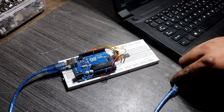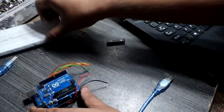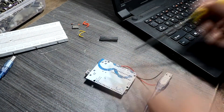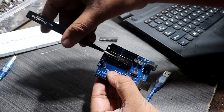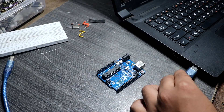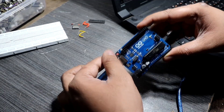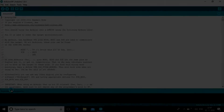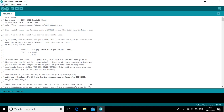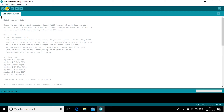Now I disconnect the Arduino Uno from the PC, then remove all the bootloader breadboard connections and components. This is the new programmed ATmega328 microcontroller chip. Now I remove the onboard ATmega328 microcontroller chip and connect our burned ATmega328 microcontroller chip, then connect the Arduino Uno board to PC. Now you can see — I press the reset button and pin 13 LED is blinking. This ATmega328 chip is ready to use. Back in the Arduino IDE, go to Tools, select Programmer, then select Arduino ISP. Go to File, select Examples, select Digital, and click 'Blink Without Delay'. Now upload the blink-without-delay code onto our new burned ATmega328 chip.